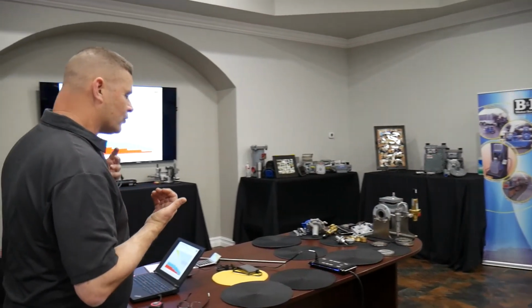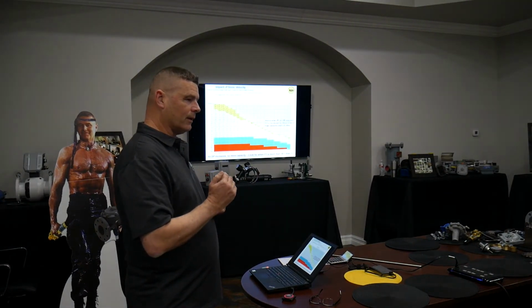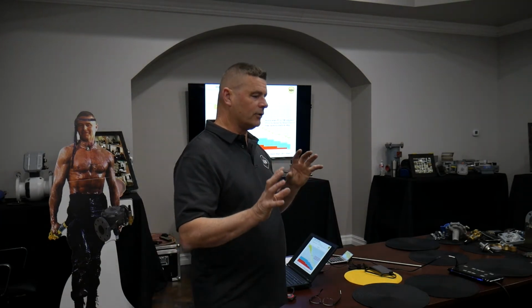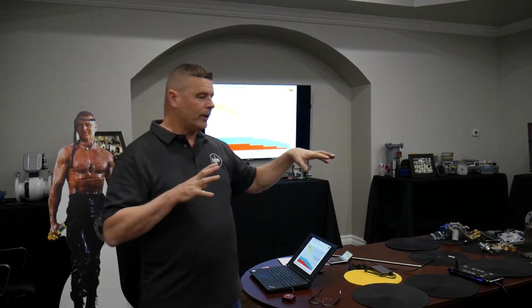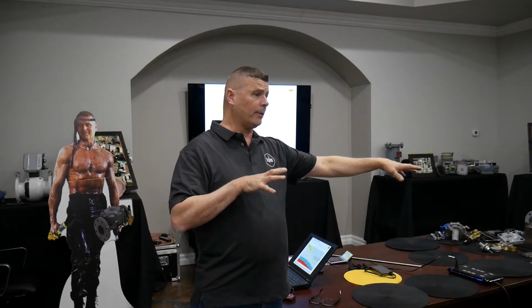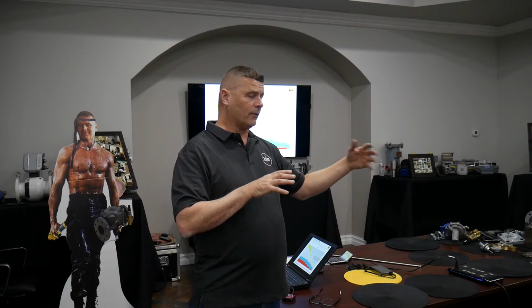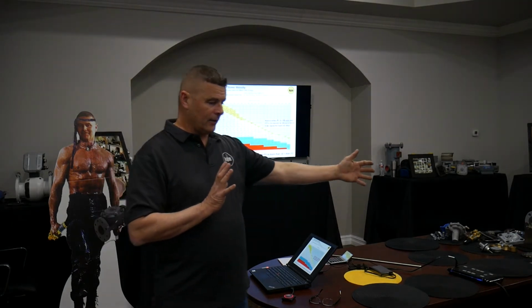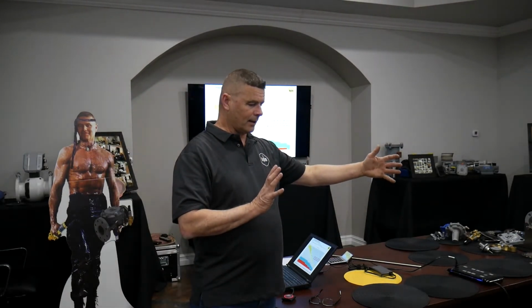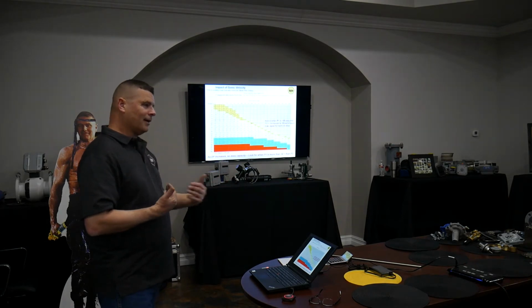So we always factor in 20% of what we're told is the maximum so that we can make sure the valve can cover it. And if we put two regulators working in series, a working monitor, because it's having to pass through one regulator and then on to the other, we always take off an additional portion. So we're actually going to use 30% as a safety margin, and that's exactly what ValveSpec does. It takes 30% away from their recommended solution, just to cover what's going on within that complement of the system, and because of the safety margin we're applying, those having the ability to flex.